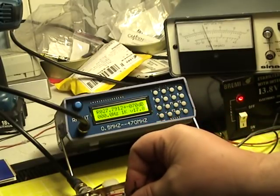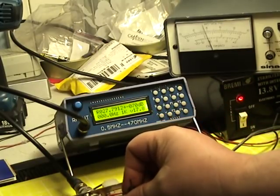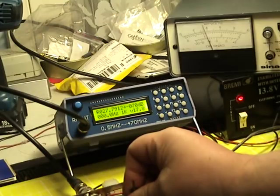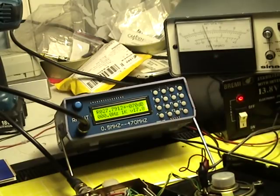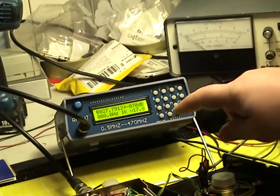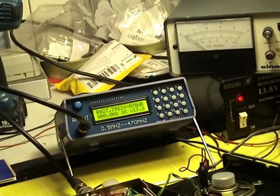I'm going to adjust the detector and we're looking for the maximum AC volts recovered. You can see it drops there and peaks there — just back up on that and there we are, definitely set as the detector. We'll now flick this over to SINAD and turn down the signal generator.